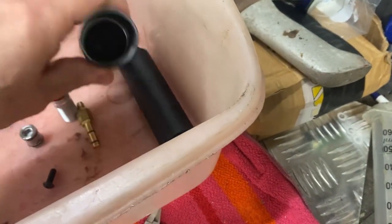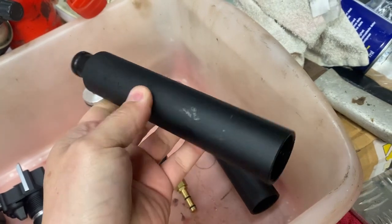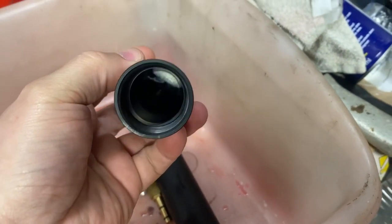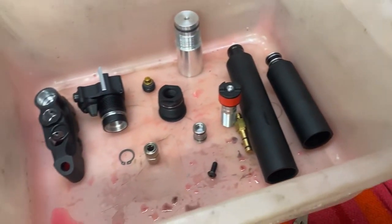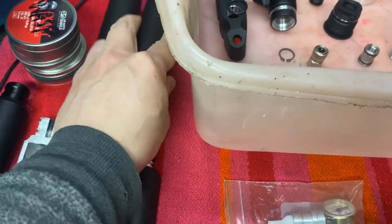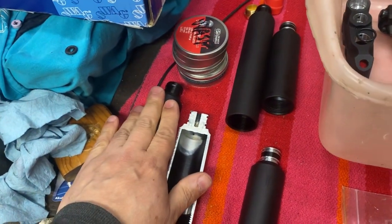And these cylinders are going back to the gun. I pressure tested these to 450 bars. There were no issues on these parts. Both are the conical bottom variant, so I should be safe on the gun. And the 2 extra cylinders I have, I don't yet know what I'm going to do with them, but I can use them as a reference if I blow this up.